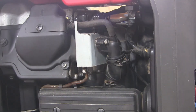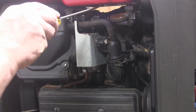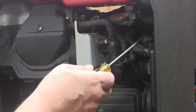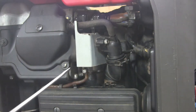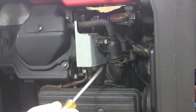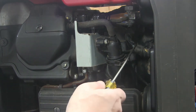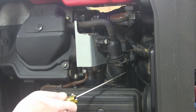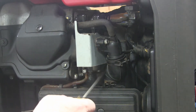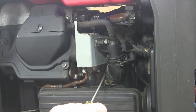What you're looking at here is the intake system of the EM5000SI generator. This generator is computer controlled. This is the choke servo, that's the throttle servo, and behind this plate is the carburetor. Inside is the inverter and it controls all this with a computer. The only part that has to get modified is — if I do choose to use the wide Venturi, I would have to move this out. The only issue is this tube, which goes from the air box where the air cleaner is up to the intake manifold — it won't reach anymore if I move this out. I would have to come up with some kind of a piece, like a radiator hose, to connect this back up.